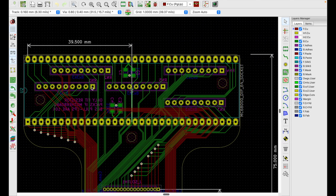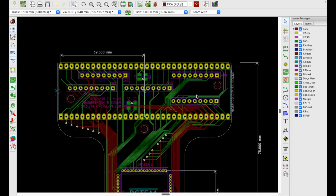I've added resistor networks for stabilizing the bus, just like on the XOS card — optional pull-up resistors you can fit if you haven't had the modification done to the motherboard itself. I could have done these as SMD resistor networks, but I thought I'd do them as through-hole resistor networks just to see whether I can fit them in and whether that works equally as well. I also happen to have some left over from my STFM upgrade. I've slapped a couple of holes in the board for support posts if needed, but there we go — that is our board design.